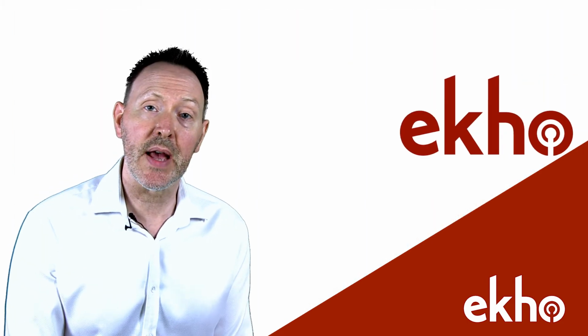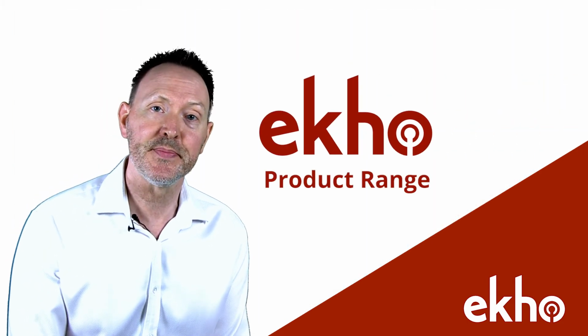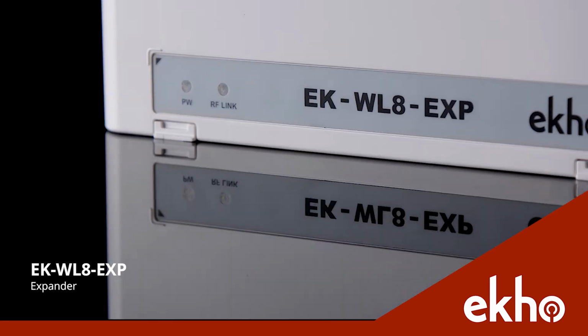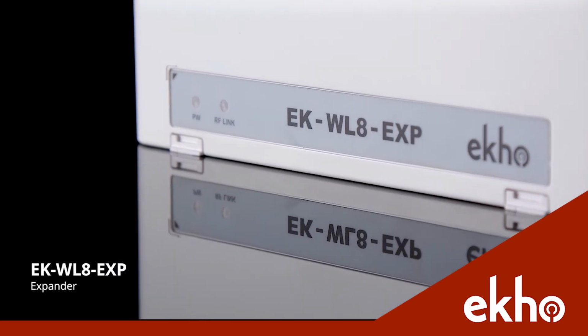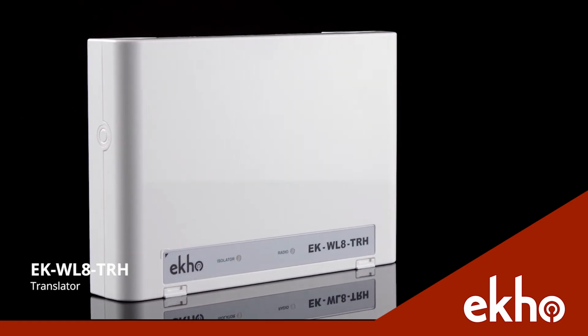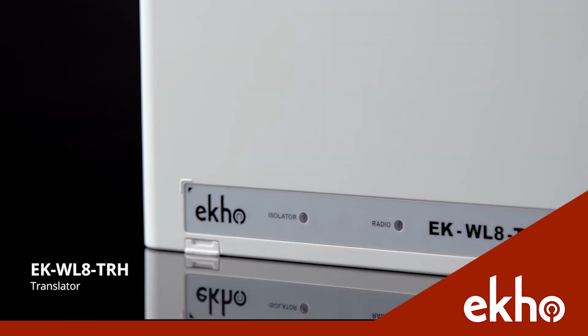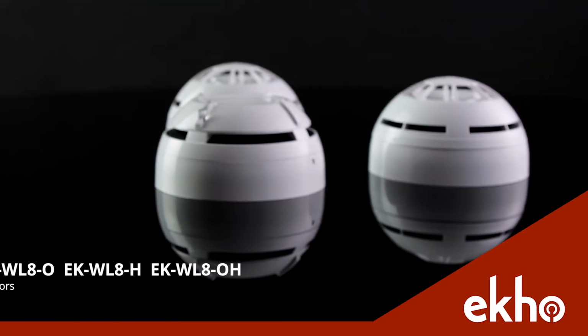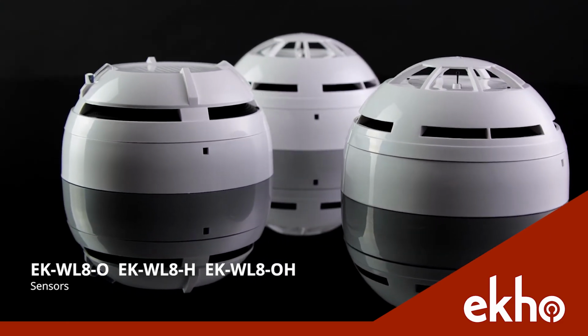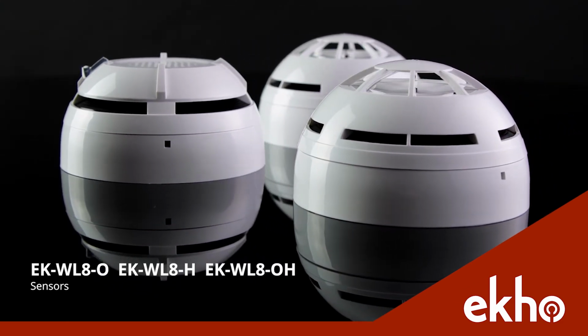Let's take a closer look at the devices in the Ekho range. The translator and expander are both compact and simple to install, and the translator features an integral short-circuit isolator. There are 3 sensors: optical, heat and multi-sensor. All sensors come with their own bases and batteries.